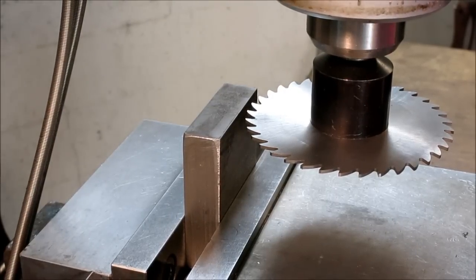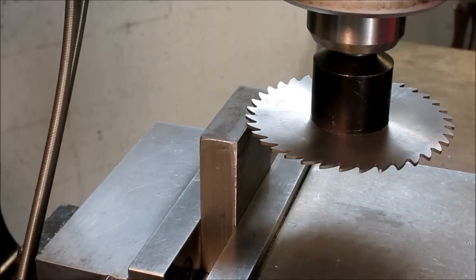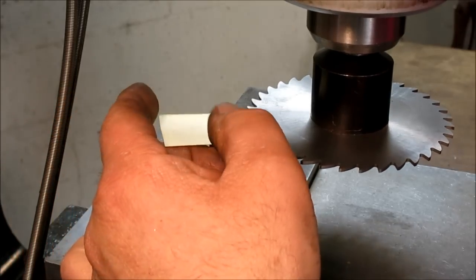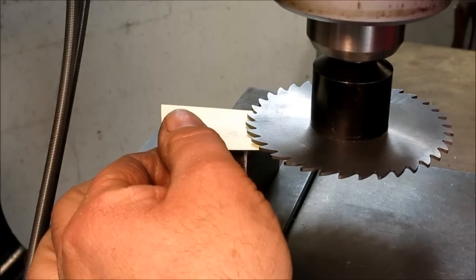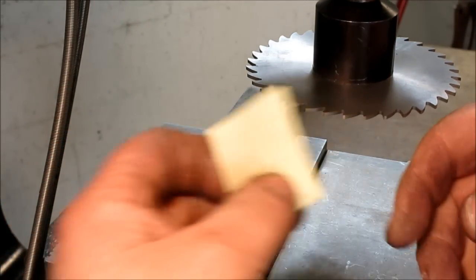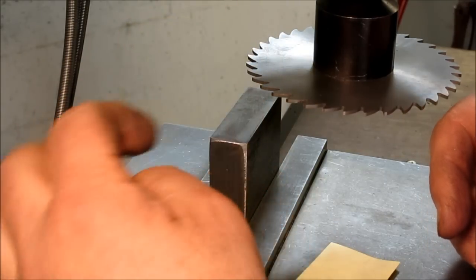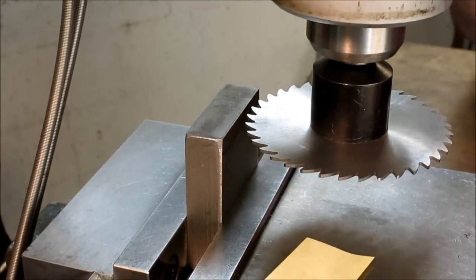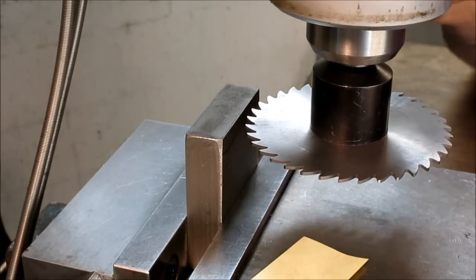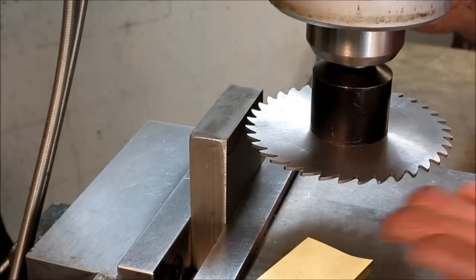Setting your depth — sometimes you care about the bottom surface, sometimes the centerline, and rarely the top surface. Now, here's where everybody gets messed up. Counter to what you'd normally think — taking light cuts seems to make the most sense — but what we really want to do is take the whole thing in one whack and not chew away at it.